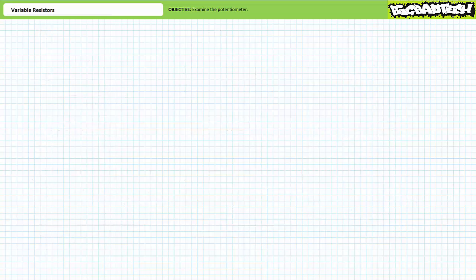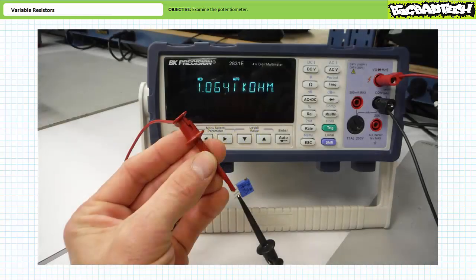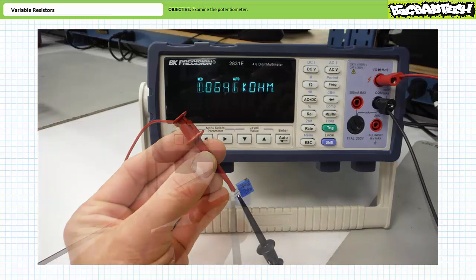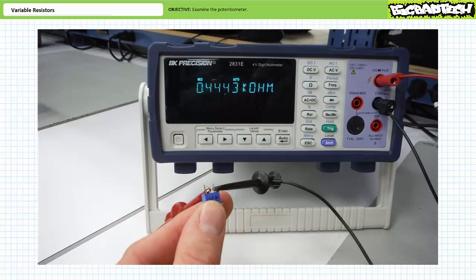Let's check out a couple of real-world potentiometers. Here's an inexpensive 1-kilohm potentiometer for low-power applications featuring a small adjustment screw on top. There is no label clearly identifying the A, B, or C terminals, but we can use an ohmmeter to figure out which terminal is which. When I check resistance between the two outside terminals, the ohmmeter registers a constant 1064 ohms regardless of how vigorously I turn the screw — these are obviously the fixed terminals A and C with a nameplate value of 1 kilohm. Transferring one lead to the central B terminal, the ohmmeter shows 626.6 ohms between B and C, and checking A to B shows the remaining 444.3 ohms.